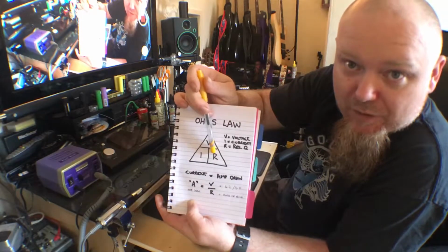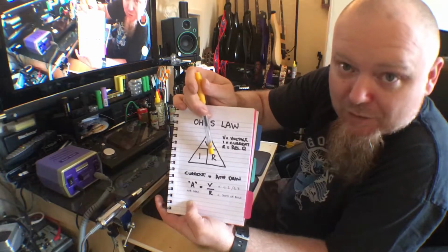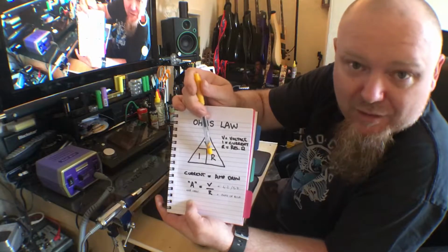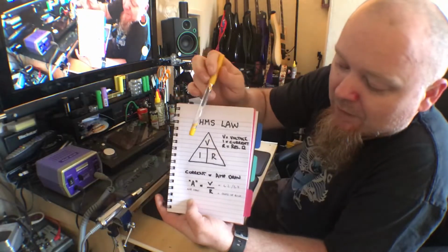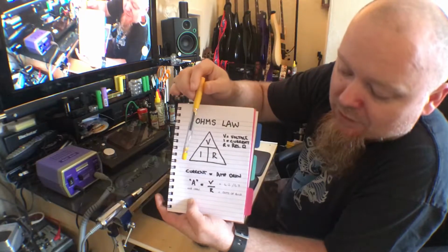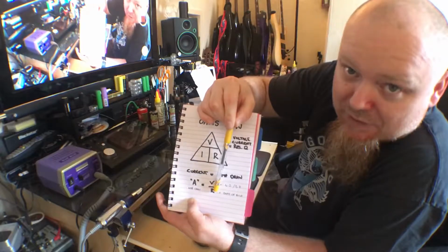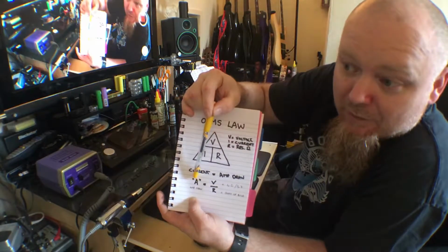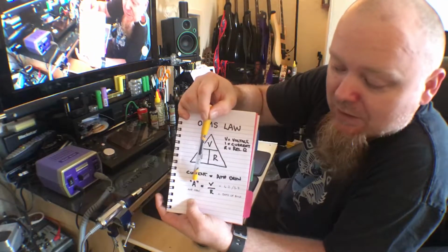Resistance is whatever your ohms are on your resistance meter or mod. If it tells you it's 0.15 ohms, then that's the figure that you use for this. To work it out, all you need to do is divide your voltage by your resistance. Whatever number that gives you is your amp draw. So your amp draw must be within the limits of the battery that you're using.